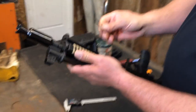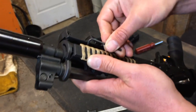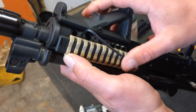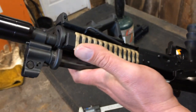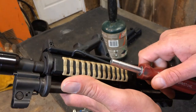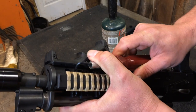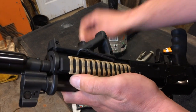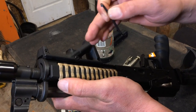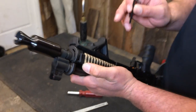First of all, this weapon is clear and safe. I did that not just by raw power and fury with my bare hands — I actually used a cheater, slipping this interchangeable bit screwdriver over the Allen wrench to get some more leverage. Trying to get that screw out, I pretzeled and twisted the heck out of it. That tells me the Loctite I put on those screws has secured it, and now I've got to figure out how to get that Loctite loose.